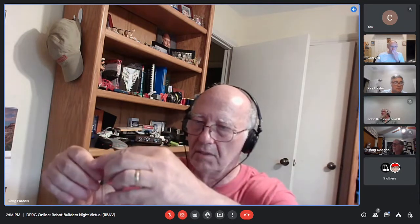All right. So anyway, these little cables that you get, the one that Ray just mentioned, this one happens to have DuPonts on the end, but you can get all various quick connectors on the end. So what I decided to try, at least to keep in the spirit of this, is I've divided the ground and the clock and the 5 volts and the SDA, and twisted these around each other, just like this, and tied them down so they don't untwist. And I'm using that to continue on.